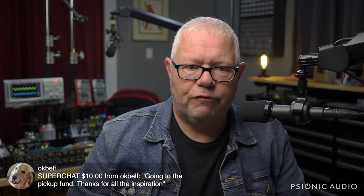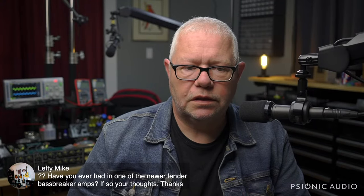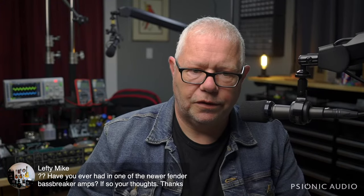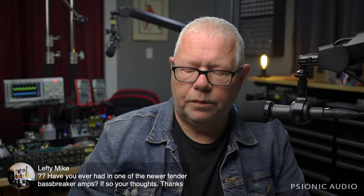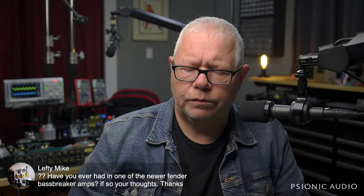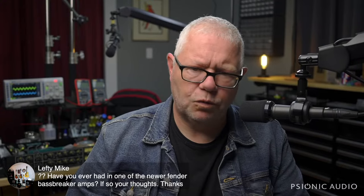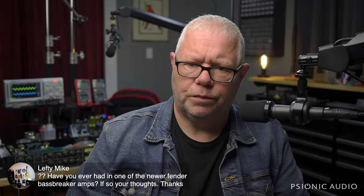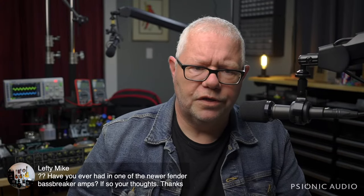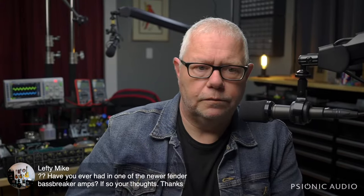Thanks, Belf. Appreciate that for the pickup fun. Very nice. Hey, Lefty Mike, I'm not a fan of the Bass Breaker amps, especially the ones which have the auto bias circuit. The auto bias circuits break down and become a very expensive repair, a very complicated solution in search of a problem, because for decades and decades, a very simple bias circuit made up of like six inexpensive components has worked for everything from a Princeton to a Marshall Major. Fender had to come up with a very clever auto bias circuit which burns itself up. And then the end user has a big repair bill.